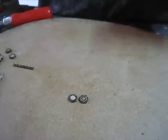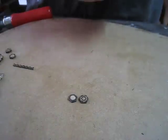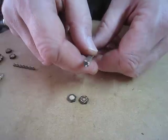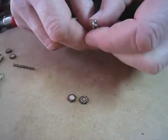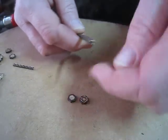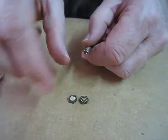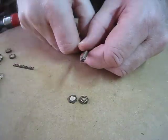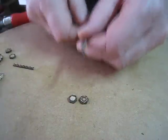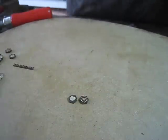So that's easy. And that would be for making one at a time, the way we can imagine the old guys did. Now, the way this was done was to make up a log, sort of like this, and then slice them off. Now, imagine getting all those pieces to go to their proper place as you're gluing them up. This was glued with thread wrapped around it to force them together. Well, because these are little wedges, 6 wedges basically that come together to form a hexagon, they'll all go to their place with the right pressure. Any pressure forces them together and the points come together. So there's no worries about getting the gluing right, as long as the cutting is right. So not quite as hard maybe as it looks to do these things.